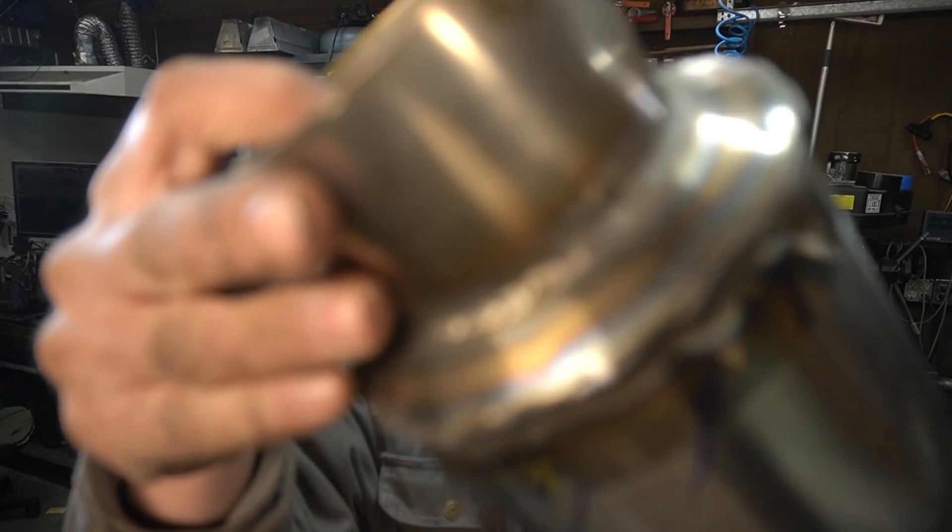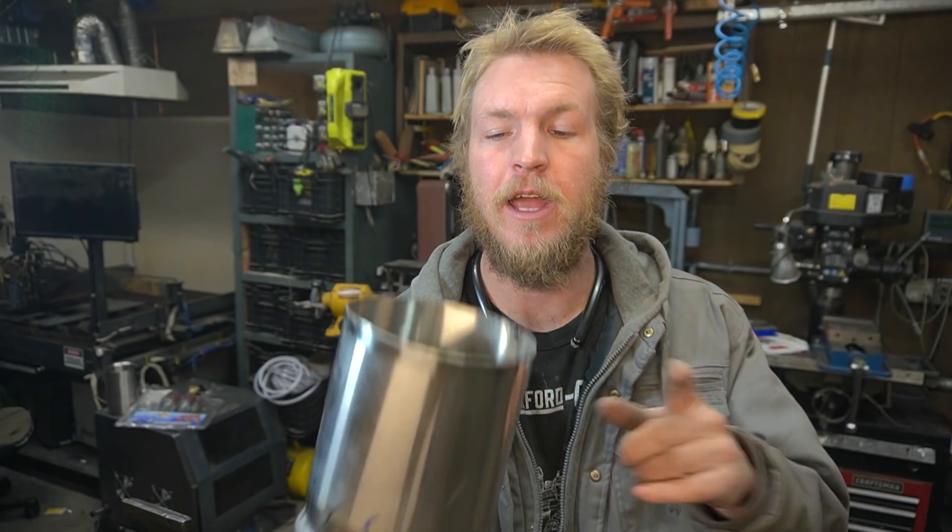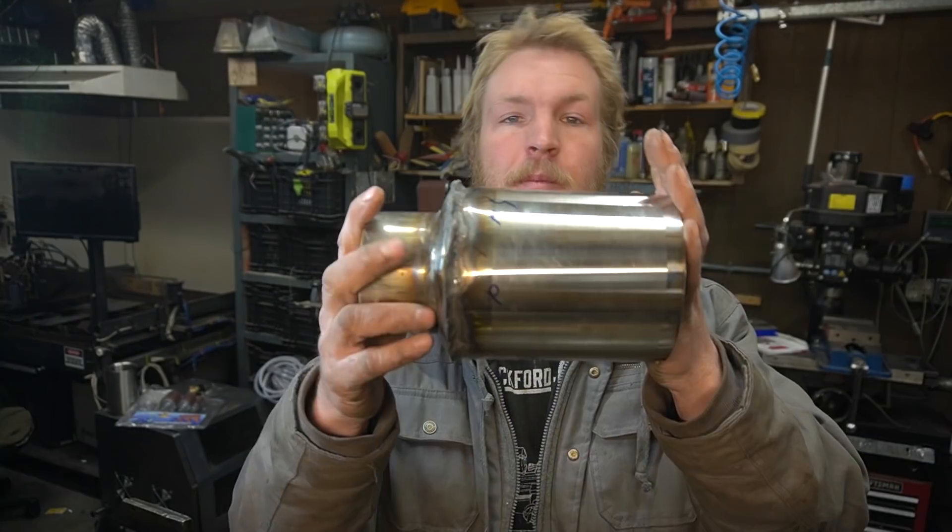This does not deserve a montage. This was hell. If you are an amateur TIG welder at best and you hate yourself, I highly suggest welding coffee cups together. It's pure misery. I tried again and again to get this thing right until I finally landed on something that turned out not great, but semi-decent enough. We don't know if it's vacuum-tight yet, but these things are so thin and made of probably the worst stainless steel you can get — it's really difficult to weld. But we did it. A full bottle of argon later and lots of pain and suffering. I do not suggest it, though.